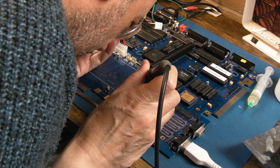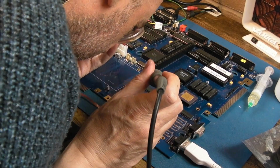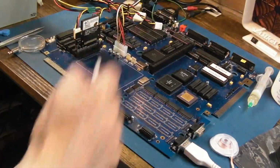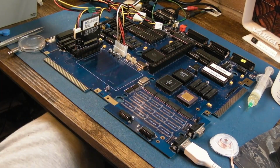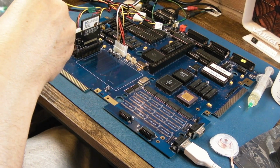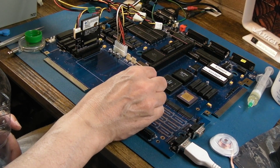Yeah, I didn't really need to do very much with the solder points on that MELF. It's already on. Yeah, just from hot air. We managed to move that across. I put a bit of flux on the pads below. So all being well, that should now mean the FPU is a bit happier. It might still not work because I'm not sure the speed of that.